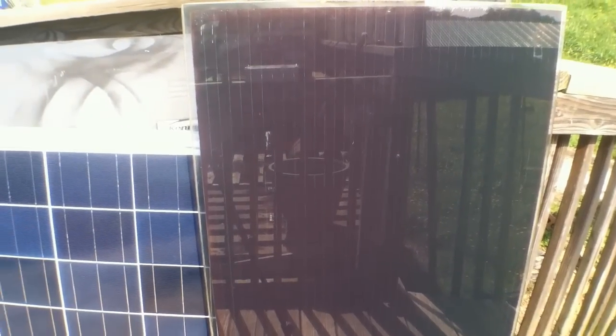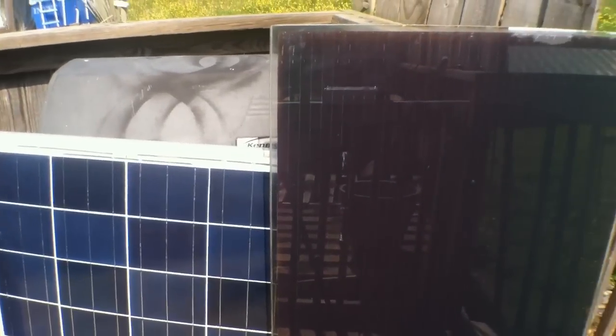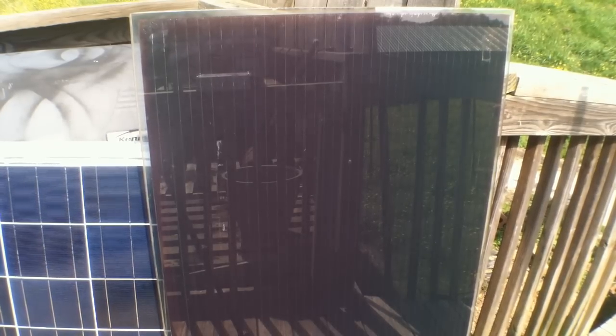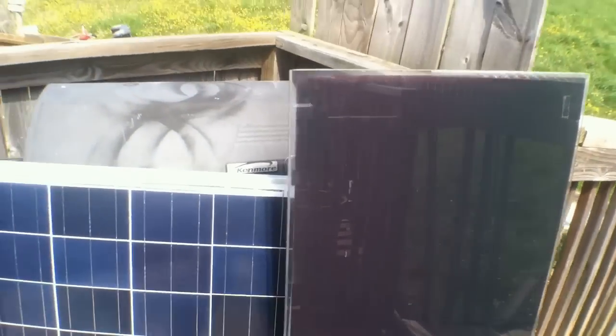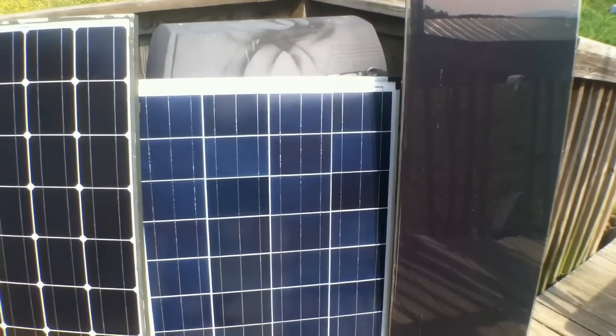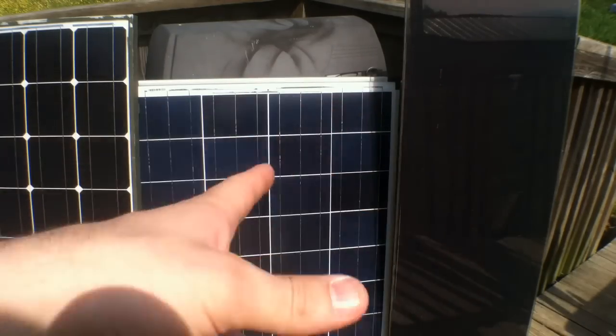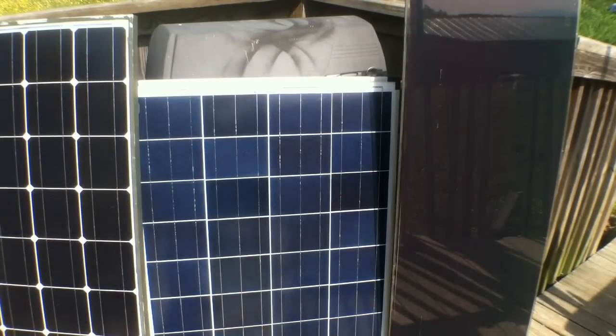I hope that's helpful as far as breaking down the differences and applications for these panels. The final notes I'd make on thin film is this would be great for a ground mount — lay it on the ground and feed a battery bank or sell power direct to your electric provider. You don't want to be slapping that up where you're going to get a lot of movement, like on a camper, because you'll fissure the glass and damage your film and then it's spent. The thin film roll-ups are great for people that want to go camping and things like that, but most often they're in small applications.